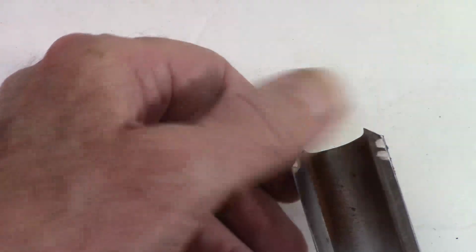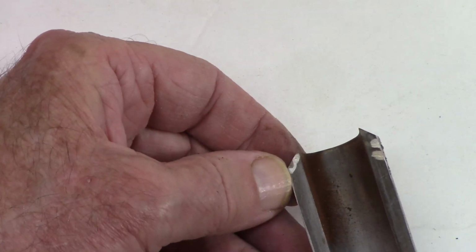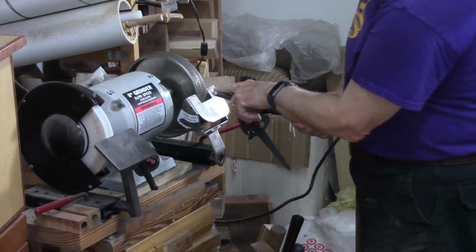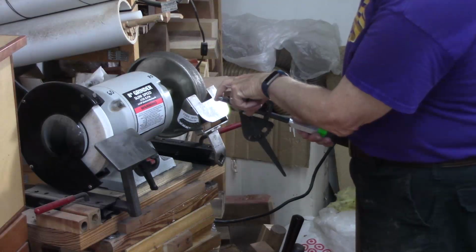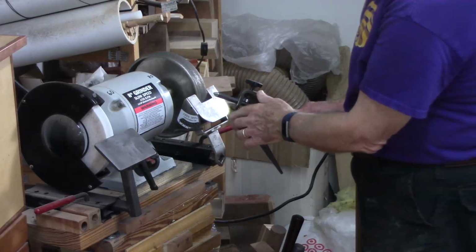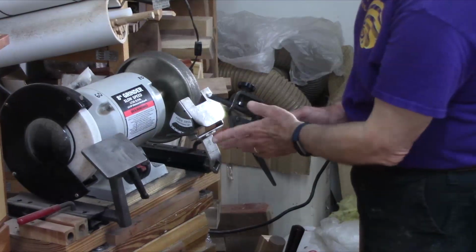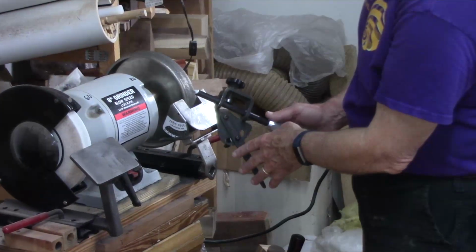Just nipping the corners flat on a grinder can be an improvement if that's how you use your spindle roughing gouge. Some turners, such as Richard Raffin and the late Ray Key, used an asymmetrical grind where they'd have one grind at one angle on the right side and maybe a swept back on the left. I don't know whether this would fall under improvement or experiment. It depends on what your preference for sharpening is. If you use a Vari grind, you cannot do an asymmetrical grind.